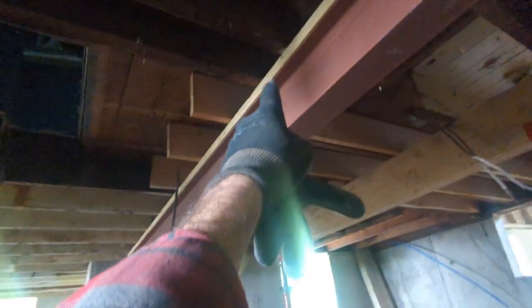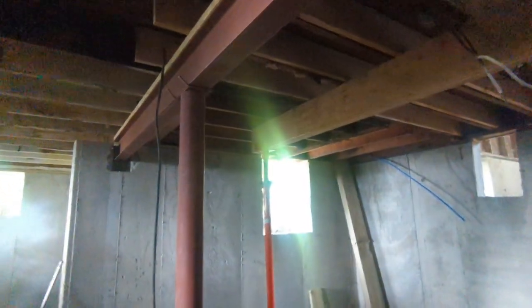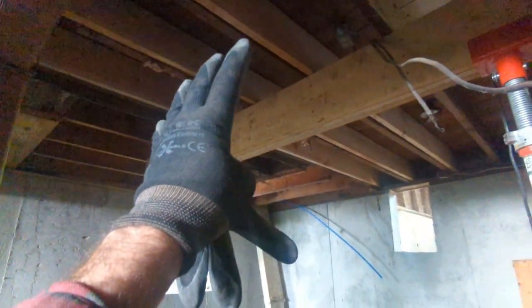And so if I'm cutting this back to where there's an inch and a half or even inch and three quarters, something on this plate, once I yank that over and I yank this over, I'm diminishing what I've got for purchase there. And I don't want to start doing math and counting on it to be correct and all of that. Therefore, this is all the sisters I'm comfortable installing without coming over here to modify.